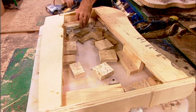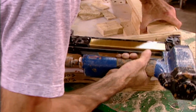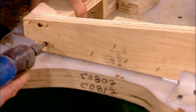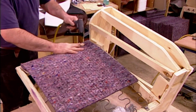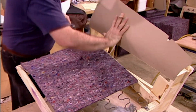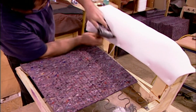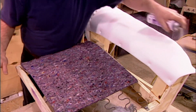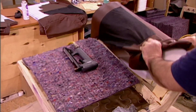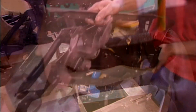The frame pieces for the arm are assembled using glue and glue-coated staples, plus a few screws at strategic points. Workers screw the arm to the seat and begin upholstering — first a layer of felt to cushion the springs, then wood, cardboard and foam to form the rounded shape of the armrest. After lubricating with silicone spray, they slip on the leather and staple it into place, upholstering the backrest and sides in the same manner.